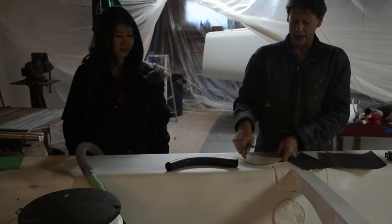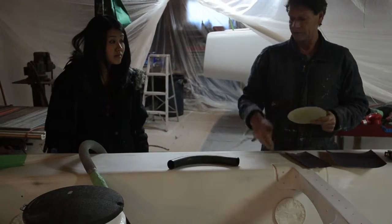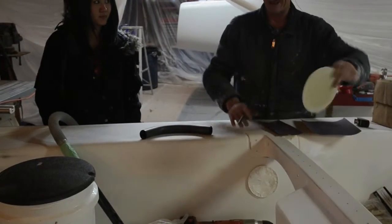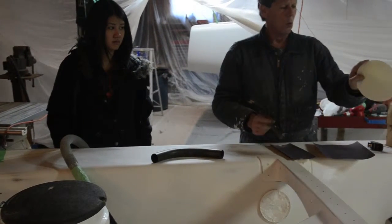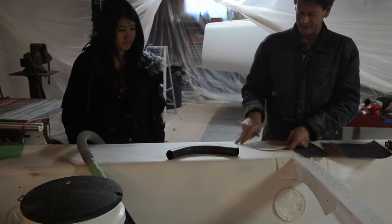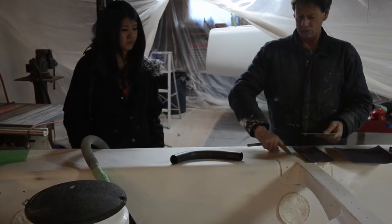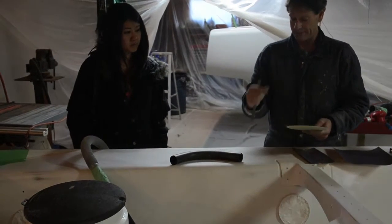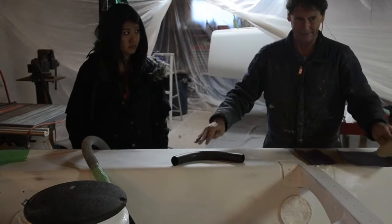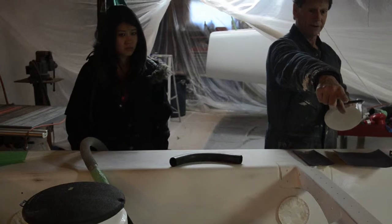In the hole. Yeah, but why was the hole there? This boat was almost crushed, so they cut a bunch of holes to reach in and do a bunch of repairs. Oh, okay. Then did some bad repairs and just put inspection ports everywhere. Oh, wow. So anyway, when this is in place, glued a little bit below this finished surface, then I kind of feather the edge of this, and then add more laminate here, and it sticks. You get some sort of bonding surface, not much, but by adding the extra glass, you end up with the same laminate, so you kind of get that same density. Right. So when this heats up, when the sun hits it, you're not going to see. This one's pretty ugly, but that one's all faired in now. Yeah. Sort of.